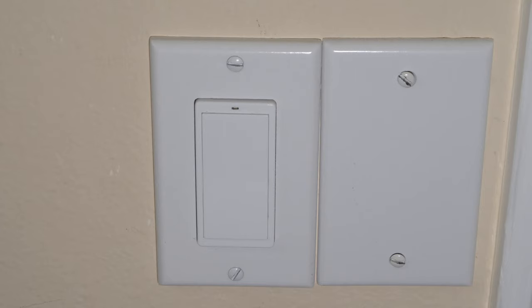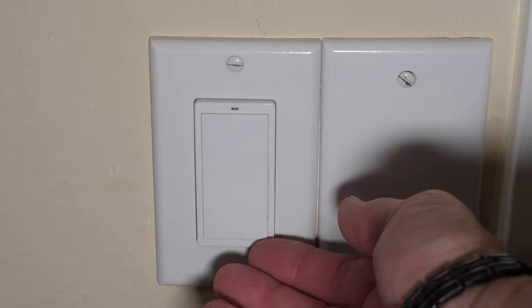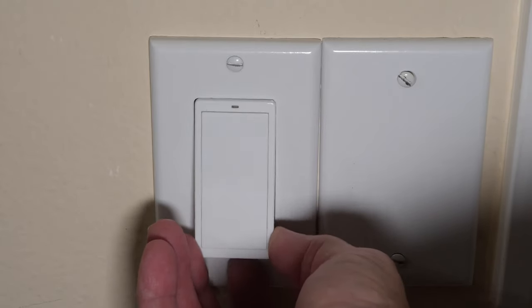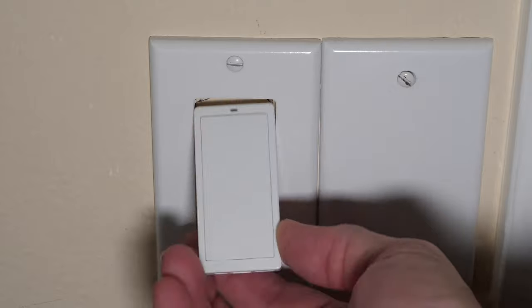Moving into the dining room, there was a unique challenge. We wanted to put a large mirror on a particular wall, which of course was the wall with the light switch on it — once the mirror was mounted, it would cover the light switch. So rather than rewire everything, I decided to install a micro switch. These are designed to mount behind the wall plate — you pull out the switch, insert the micro switch, put a blank plate on top, and then use another device to control it. In my case, I used a mini remote mounted on a different wall, which allowed me to control the chandelier light without any rewiring at all.